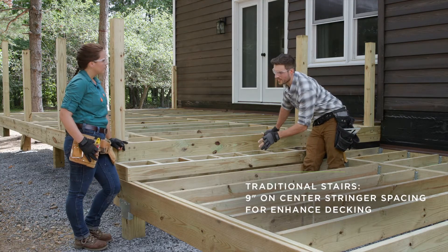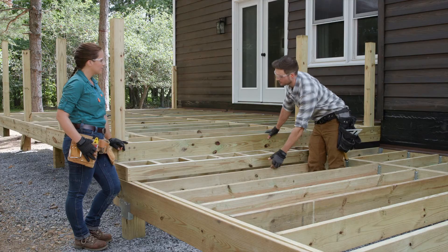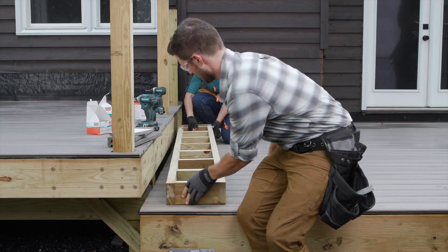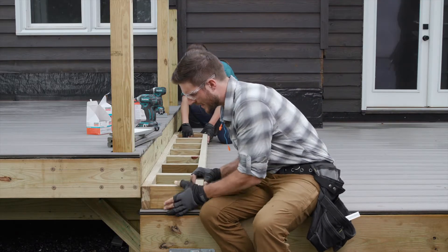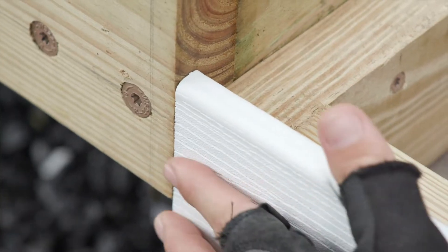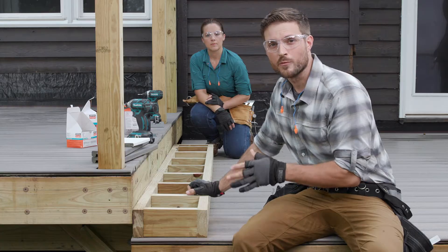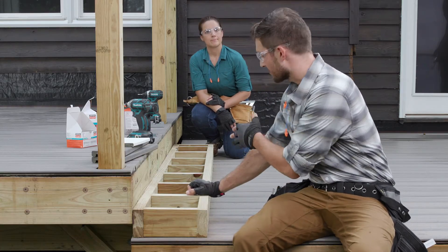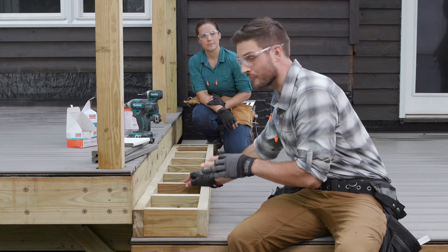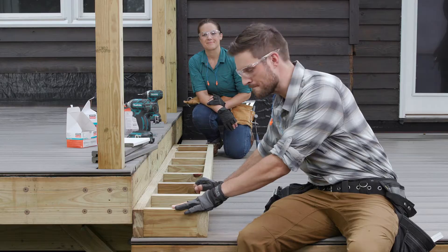We're planning a little ahead — I'm going to be installing this on top of the deck boards once I add some blocking for additional support. With an inch of deck board here and an inch of deck board there, the transition height will still remain the same. I'm going to set this down, slide it up against that rim joist, and set it back just the measurement of my Trex fascia away from that front rim joist. We had to do some things before we were ready to install our box step: Lindsay installed all the support blocking needed, and we've already installed all the deck boards.